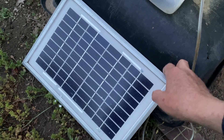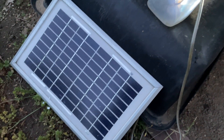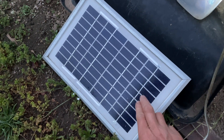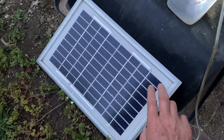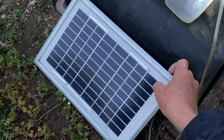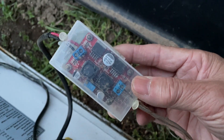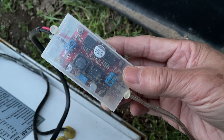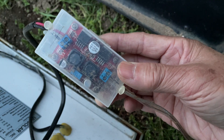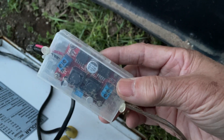This is also a more powerful solar panel — it's five watts. So in the winter it works out better for the solar light. Since this is a 12-volt panel, I have to bring the voltage down to five volts. Back here is the boost-buck converter, which converted the voltage down from 18-volt open voltage to five volts.